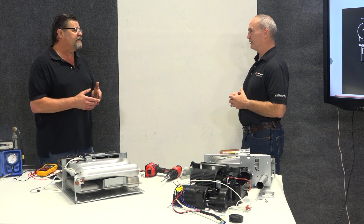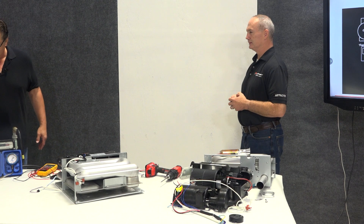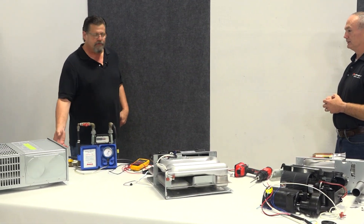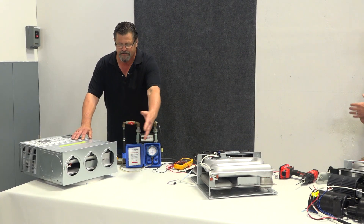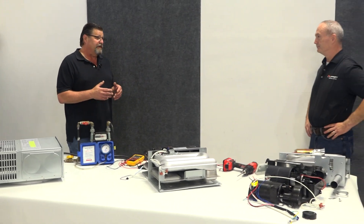What other things can cause it to overheat? If you have flex ducts and one falls off, hot air just dumps right back into the furnace — it recycles. A furnace has a hard time heating hot air and it'll cause it to overheat. You don't want hot air in the return air.